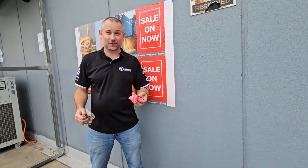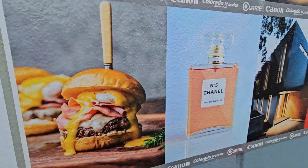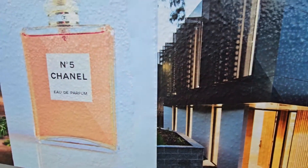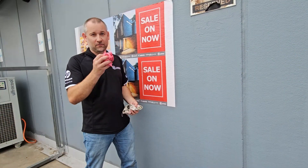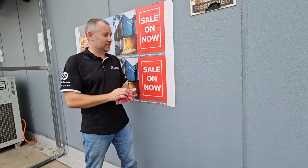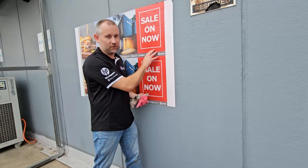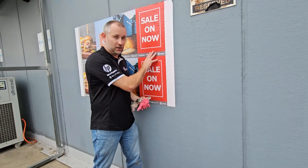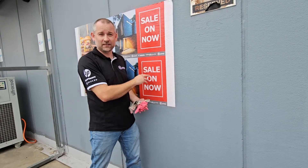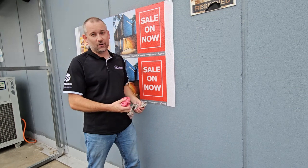To be honest, I'm pretty impressed with these results. We've put a lot of chemicals into this and you can see the ink film is still pretty well intact. There are a couple of areas where it's worn down a little bit, but I was not expecting a result like this. If you look at the colour of the cloth, it's clearly taken off a lot of the paint and virtually none of the ink film itself. These inks aren't designed to have anti-graffiti properties and we're not saying it's safe for anti-graffiti use, but they are very very durable. It's been out for two days, soaked in chemicals in some spots, rubbed hard, and you can still see the print on the vinyl. Pretty remarkable.